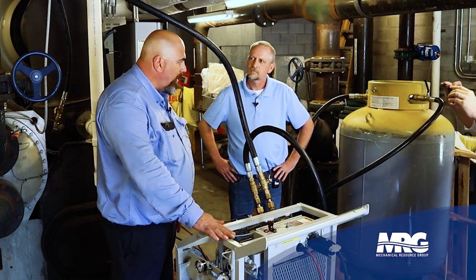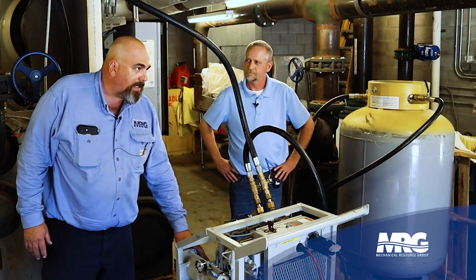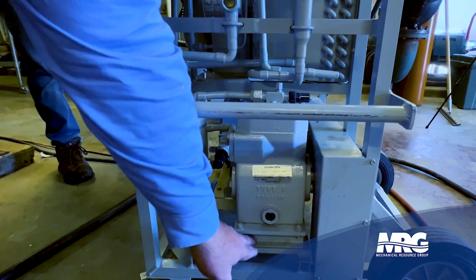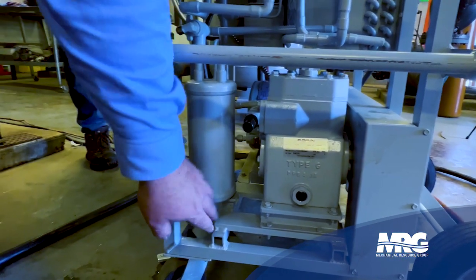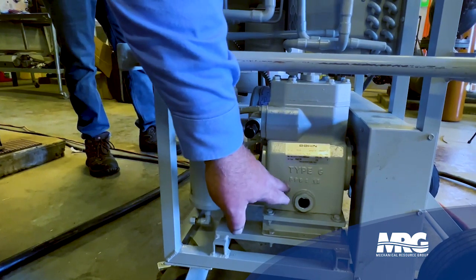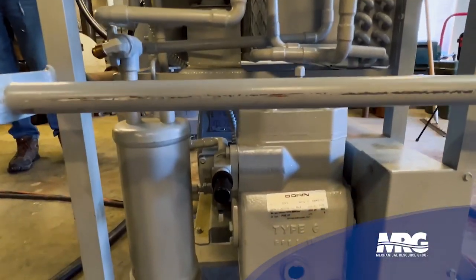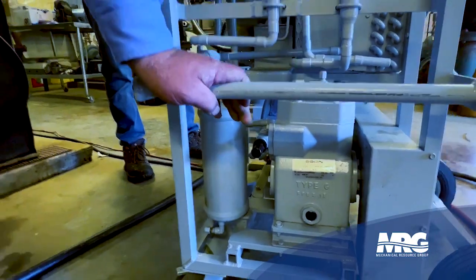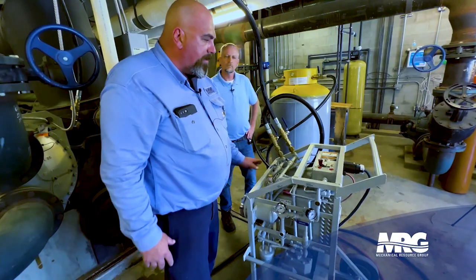Another important thing is to have this machine serviced prior to starting up. There is a desiccant dryer, here's your compressor — you want to change the oil in your compressor. There's a drainage port underneath here that you drain the oil from, and also in your oil separator there's a drainage port you have to drain as well. Go ahead and fill your sump — you use the same oil that your chiller uses. So if this is a POE chiller we would put POE oil in here; this is a mineral-based chiller so we're using mineral oil.